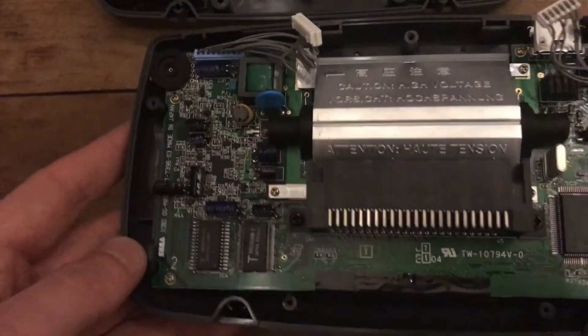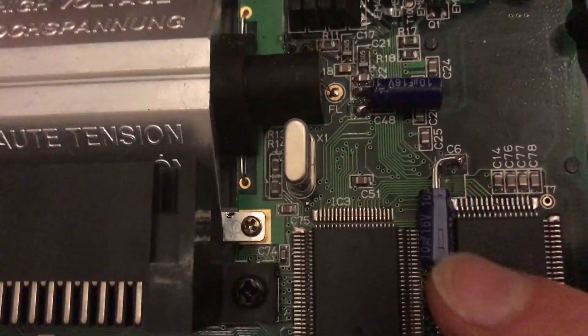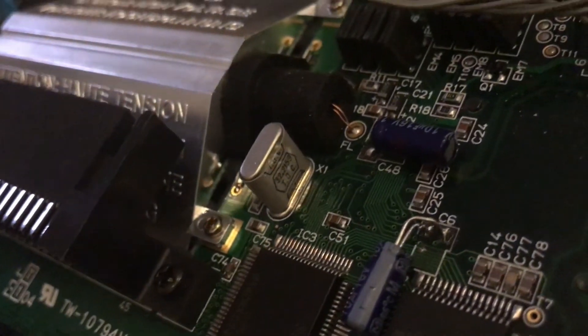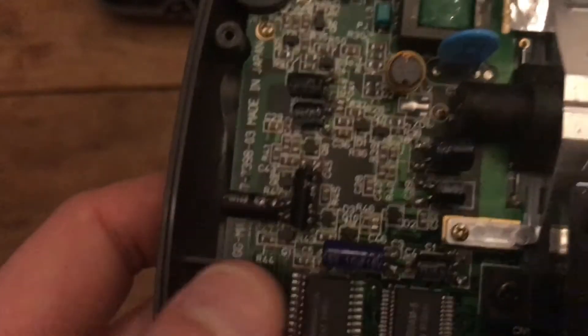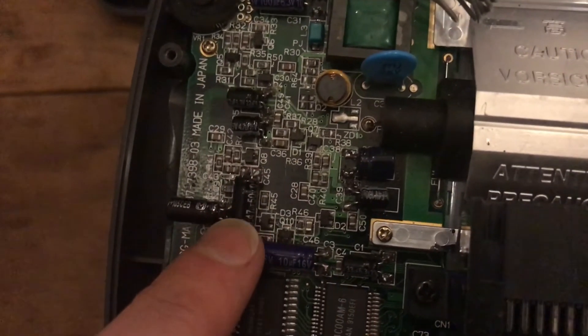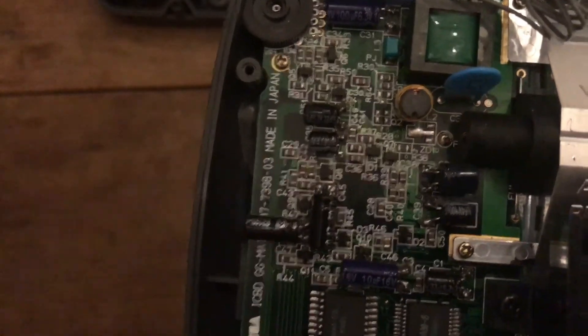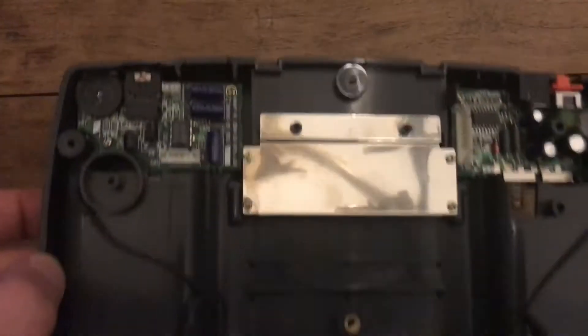The recap has been done. Just wanted to point out some of the more difficult ones. I had slightly larger caps than the original ones on here. This one in particular was slightly more difficult to get on there — I had to bend the legs over itself in order to avoid having it get into this area. The other issue was with these two: one actually had to be flipped to the other side because it was longer and didn't fit the original orientation. I checked with the back half and that doesn't seem to obstruct anything. While I was doing that, I also redid the ones up here and these three on the power board. So I'm going to put this together and we'll see what it comes up with.